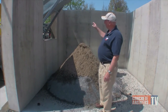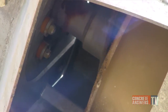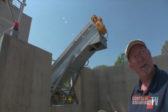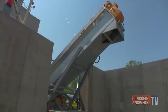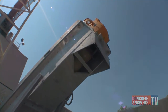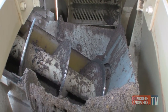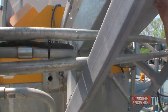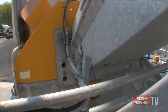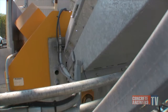The unique thing about the Bibco auger is that it is in a urethane blanket — it is not a steel flighting in a steel chamber. Therefore, we can maintain much tighter tolerances and remove more sand fines and aggregate fines from the washed-out concrete. There's a jack shaft that the screw is mounted on and a bearing mounted within the shaft itself of the auger, so that the bearing is, in all cases, above any moist or wet solution that is in the machine.